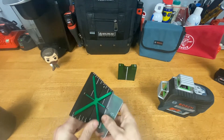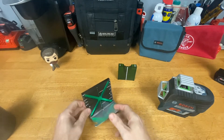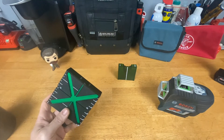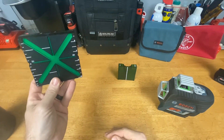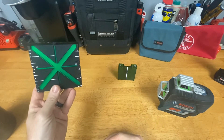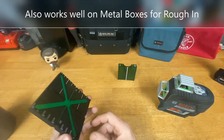This card measures four by four and it is magnetic — pretty strong magnets. You could put it onto something like a metal cover if you needed a bigger base. For me, when I'm installing drop ceiling, it will actually attach to the grid so you can snap it on there and then raise and lower your main tees to get them where you need them to be.